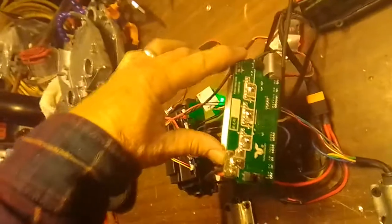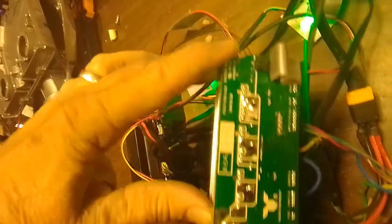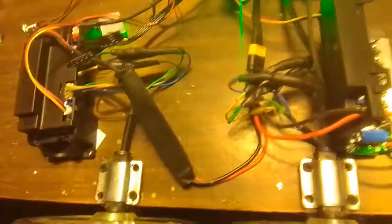One thing I've done is there were a couple of foot switches on the top of the hoverboard, and they were simply just optical switches that had a nice waterproof membrane that would push up and push through these little optical sensors. I just have a piece of duct tape covering the light path on that one, and I have the same thing on this one, just so I don't have to try to be standing on something or pushing the buttons. It's as if I'm standing on the board right now with those pieces of duct tape covering those switches.